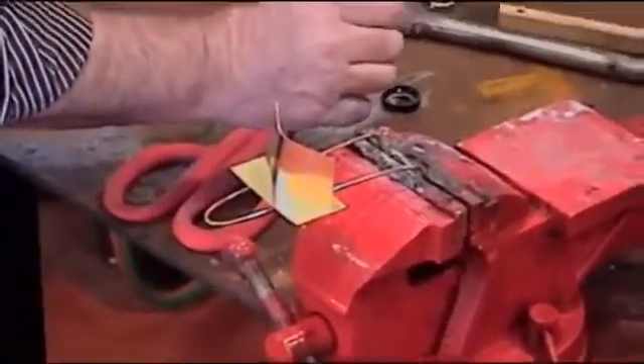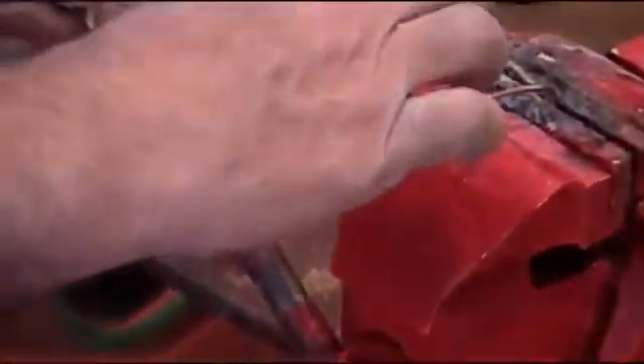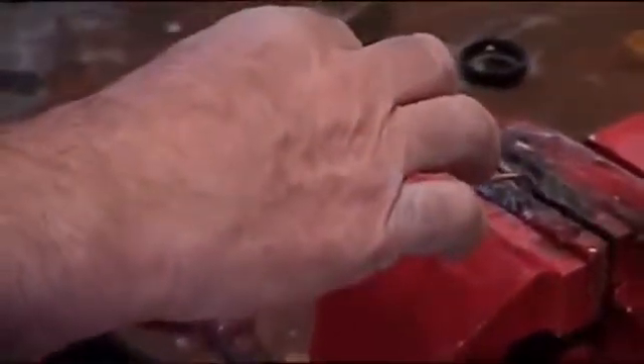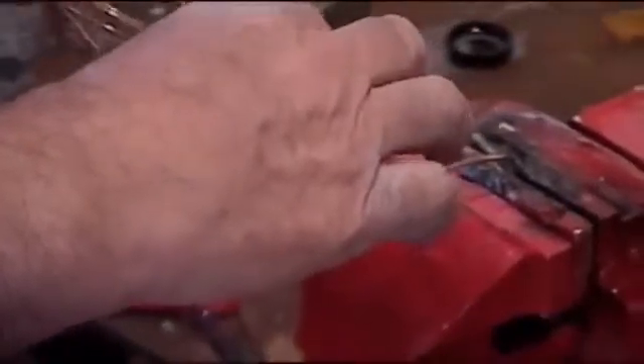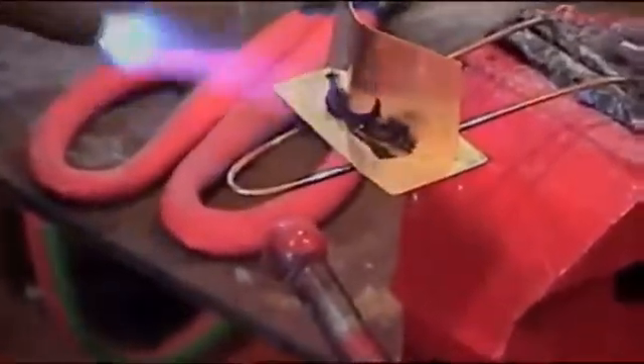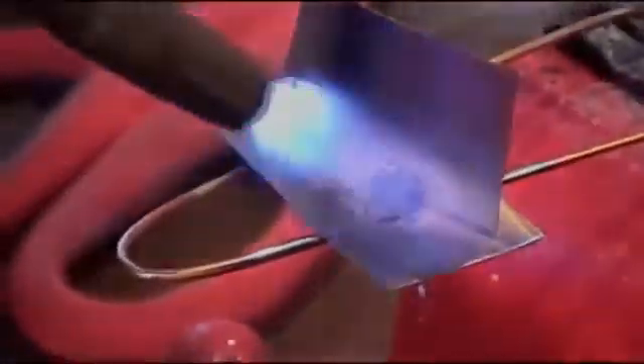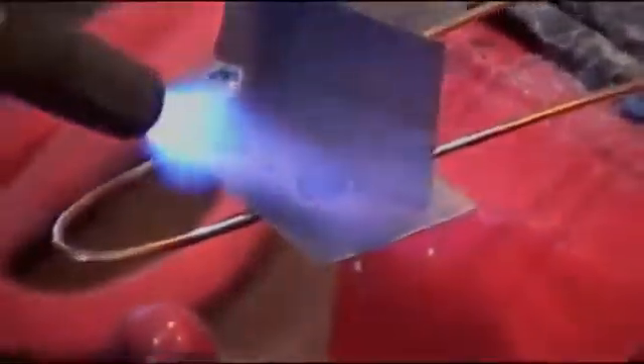This is dissimilar metal and it certainly will work on all ferrous and non-ferrous metals, except your white metals — it won't do aluminum or zinc, but we do have products for that. We're going to run the torch and watch the black flux work. It's going to bubble around, get a little dry, then go back to liquid. We'll just keep our flame moving and wait until it starts to get watery.